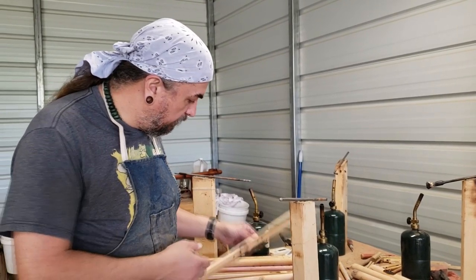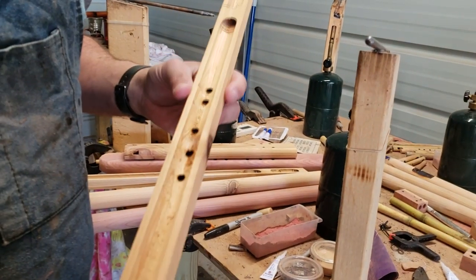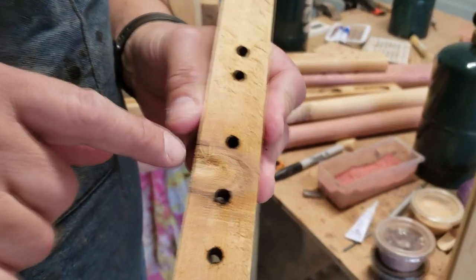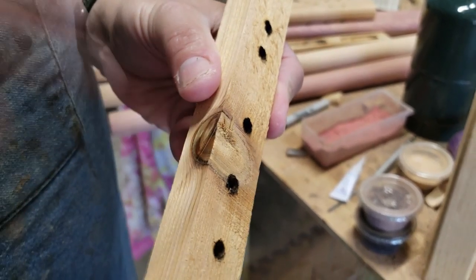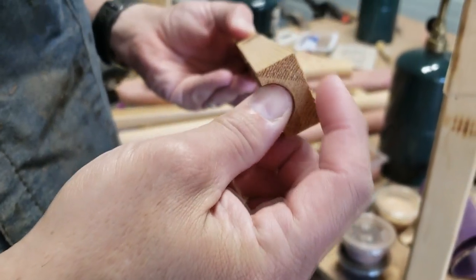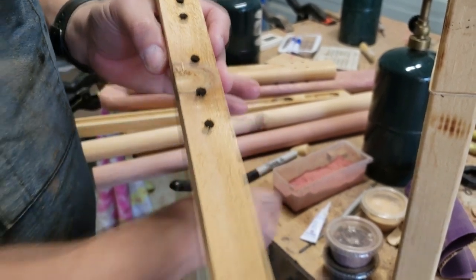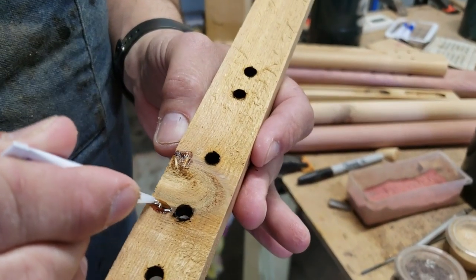Take a look at what we've got here. This is a flute blank that we make, and the flute blank looks pretty good. It needs some cleaning up, which we usually do before they're put together. This is a knot hole, and this knot has a pit inside of it, and of course there's some cracks where the knot is separating. If I run this knot on this blank through my planer to make it about an eighth of an inch thinner, it'll smooth that off a little bit, but it'll also peel it up and break it. So one thing I do to keep that from happening is put just a little super glue around the edges of the knot.